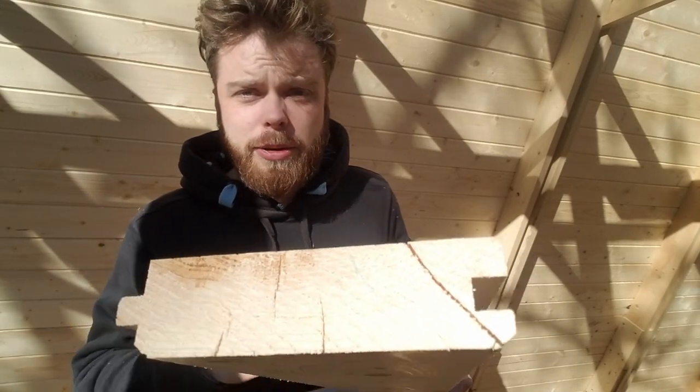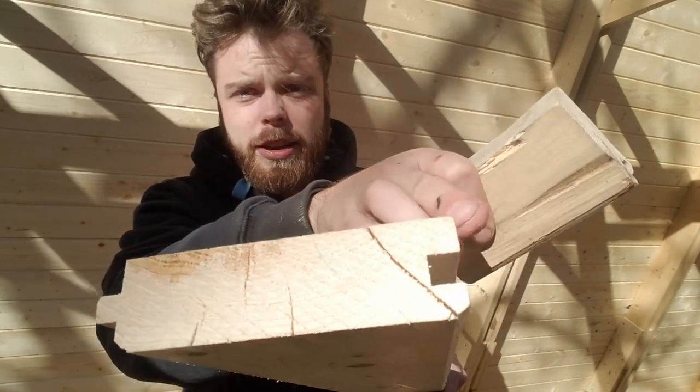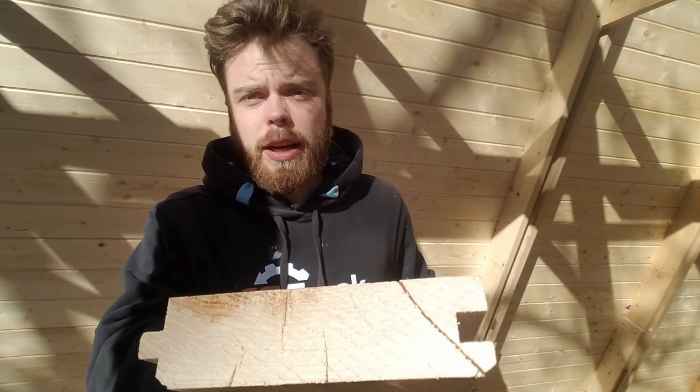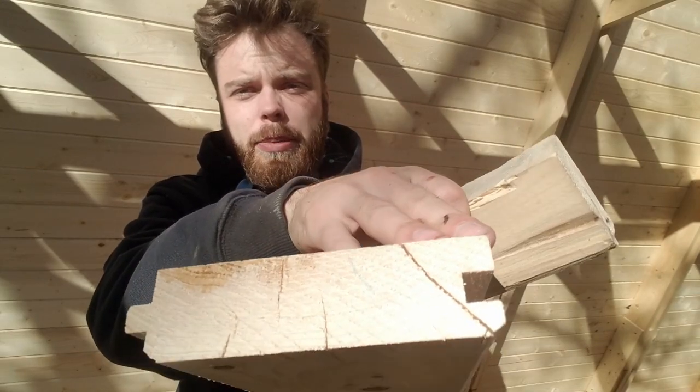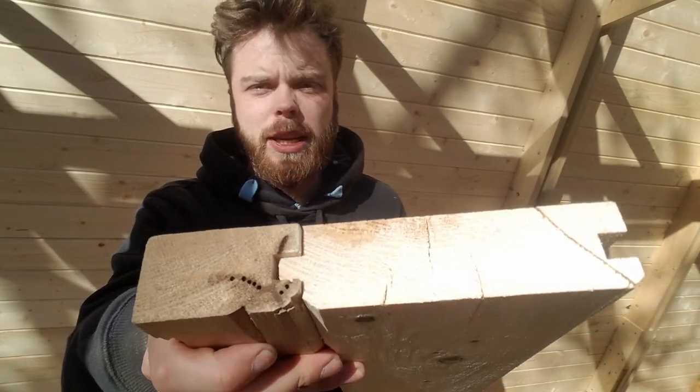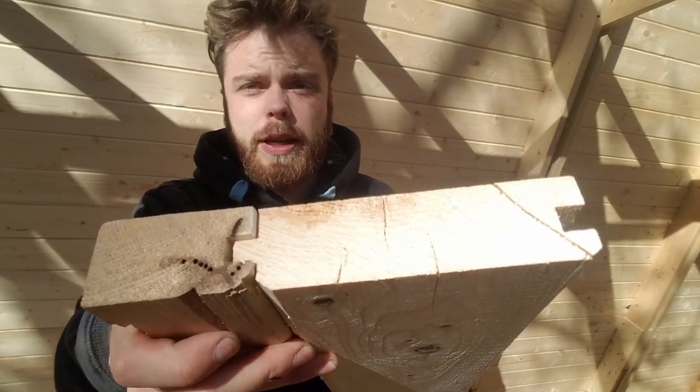As you've probably figured out, the name tongue and groove comes from the tongue and the groove of the boards. They're basically a way to build a structural plane. Before you had OSB or plywood, if you had a really nice mill nearby that could mill this kind of complex piece of board, the boards slot together to make, once you nail it all down, a really strong plane. Before you had plywood or OSB, you might use tongue and groove to build your roof plane and your floors, because those need to be really strong, and then you might use something like car siding or shiplap to build your walls — it's all the same idea. It's basically building a flat plane from a bunch of planks.